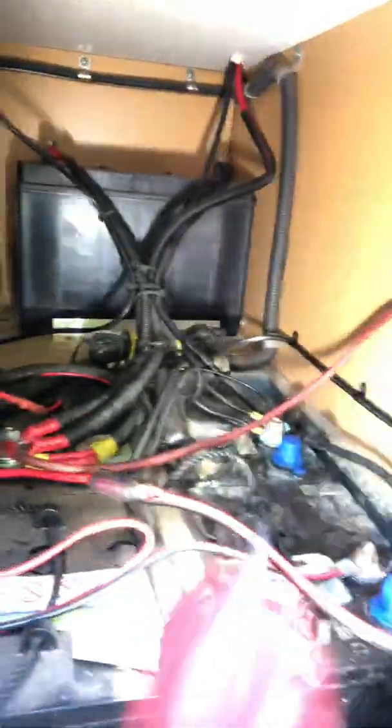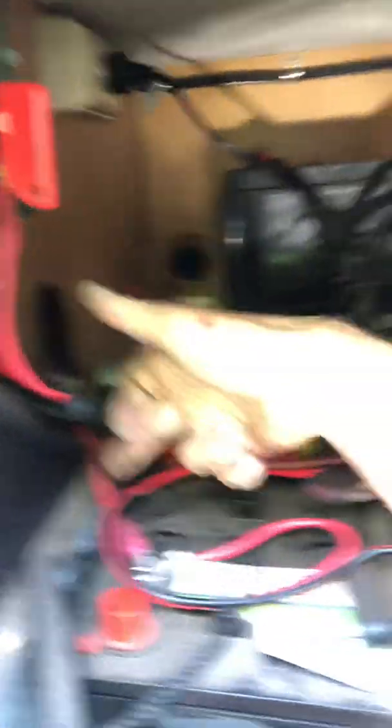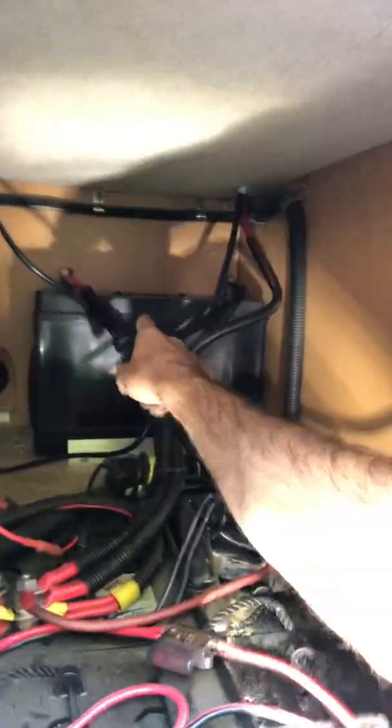It runs through, and then what's worse is it goes to what we've got here — the incorrect linking of the batteries. No fuse has been installed either. What we've got here is the main inverter feed coming off there, and the main negative coming from that there. These batteries are only linked with 10mm² cable — 10mm². Okay, these are 25mm² up there, but still, it's insufficient to run this inverter. Definitely not to install specifications — if there's an issue with this, they wouldn't warrant it. Horrible.